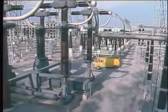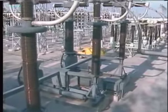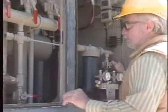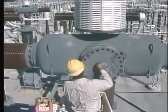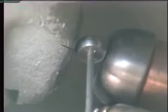The last breaker we're going to look at is the air blast breaker. Some checks unique to air blast breakers include measuring the space between the arcing rings and stationary contacts, checking the space between the arcing rings and arcing probes, and checking air consumption. To get inside the breaker heads, an isolation valve is closed to prevent air from flowing to the heads and a drain valve is opened to release pressurized air. After pressure is bled to zero, the inspection door on each head can be opened. The internal components are cleaned and inspected, and for this type of breaker the space between each arcing ring and arcing probe is checked using a go-no-go gauge.